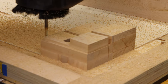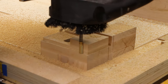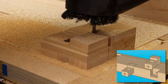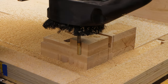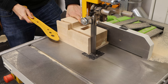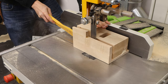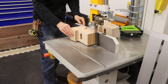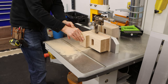Back to the build. The loose tenons are made with one dovetail shaped end and a slot cut for the bushing to sit in. They're free floating — in other words, they won't be screwed in. The bushing sitting in the slot allows the screws to push and pull against the tenons while preventing the bushing from twisting. The slots are slightly oversized, allowing for subtle movement of the bushing, which should prevent racking of the screws without meaningfully changing the vise functionality.